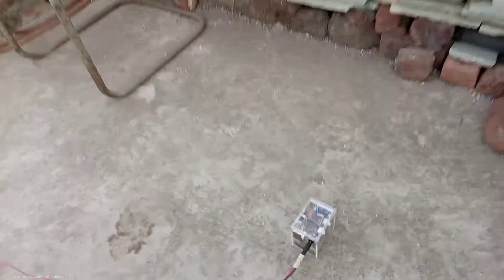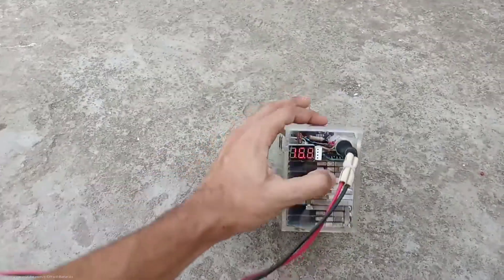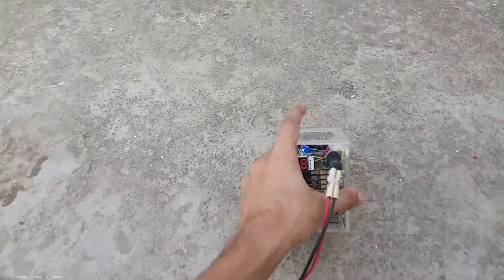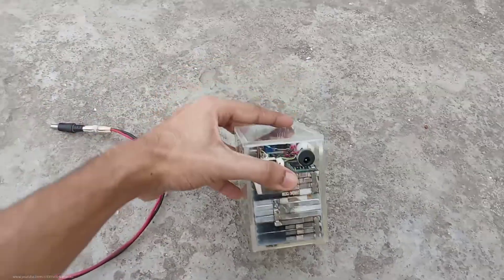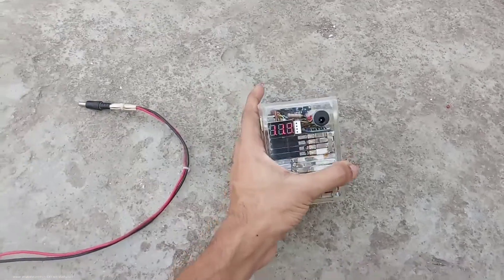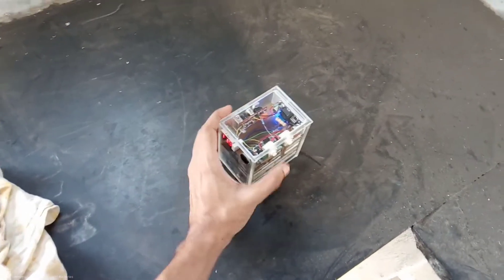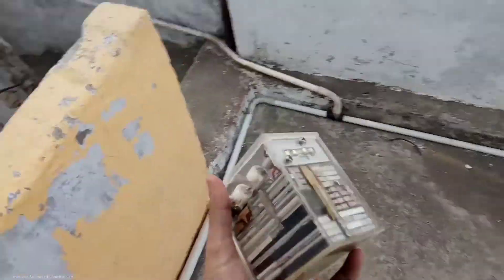The battery is now fully charged and this is how it sounds when charging is complete. It's showing 16.8 volts, which is the solar panel voltage with no load. After unplugging the solar panel it shows 11.9 volts. We probably need to connect a bigger load to reset the BMS. It's actually very hot — if anything goes wrong this will be a nice power bomb instead of a power bank. Let's go downstairs and connect some bigger loads.